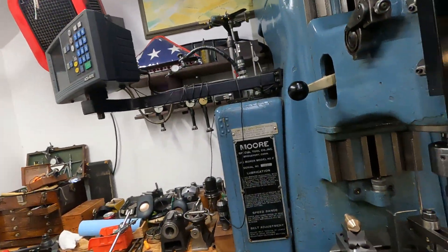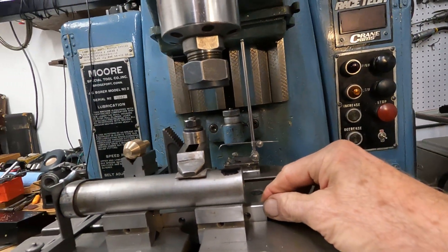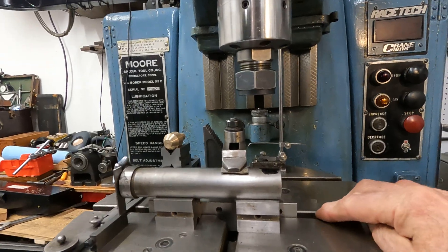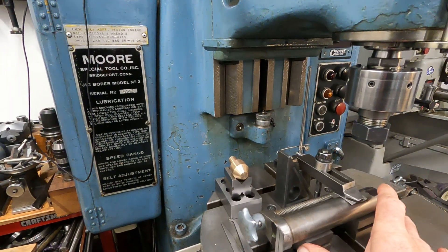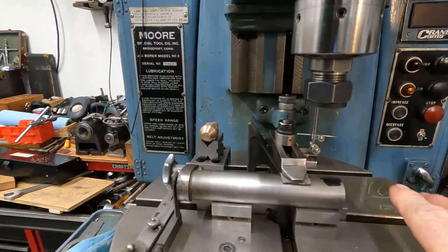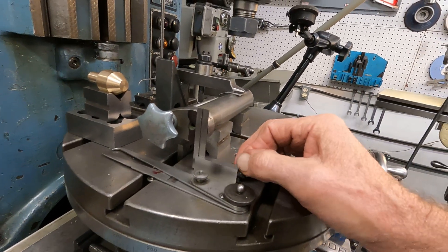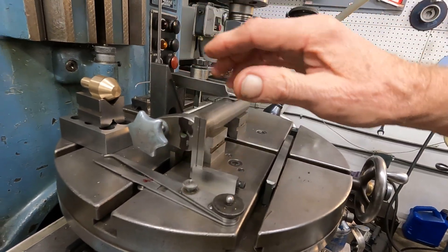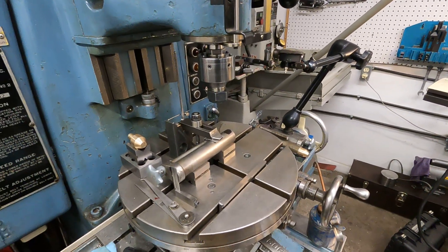I'll be back — I'm going to drill some holes here. I've got a ground piece of steel in the table slot, and the table is trammed into the machine so it's easy to clamp the workpiece on V-blocks, slide it against that stop, then clamp it. I showed in an earlier video how I leveled and indexed this. We'll be back soon.